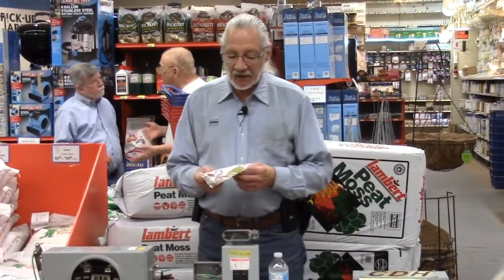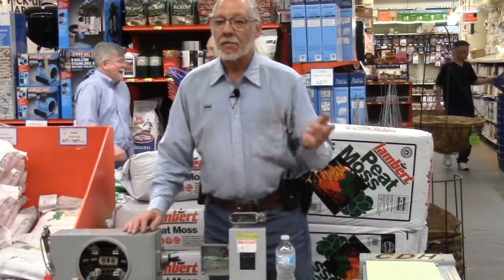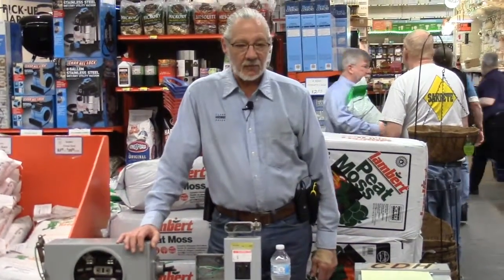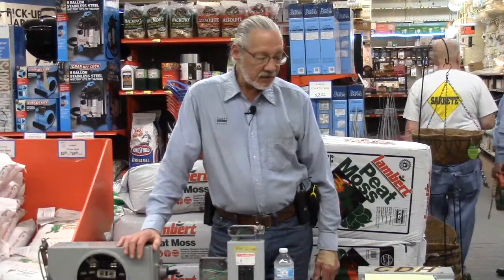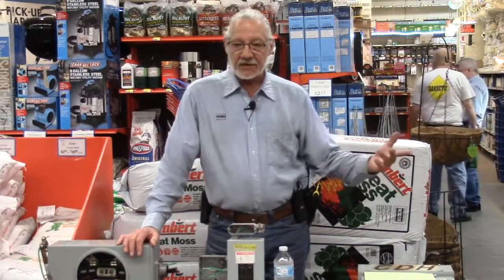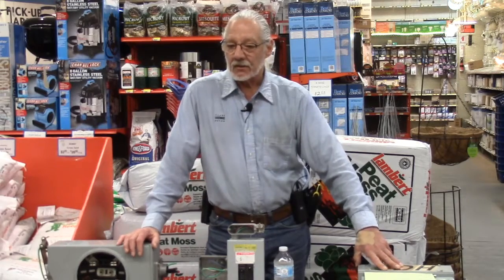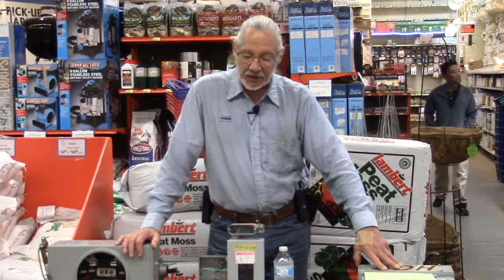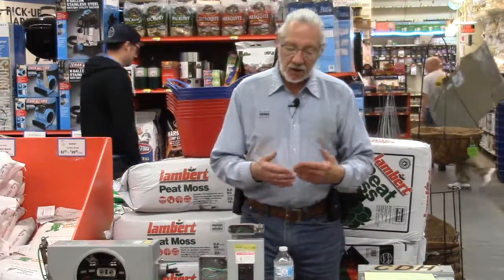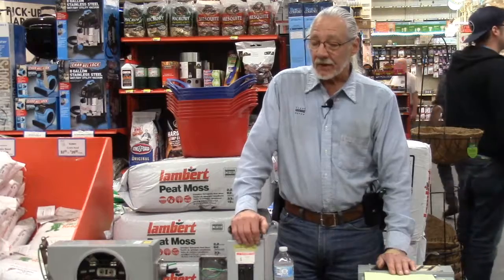Just be aware that if you try and jury rig something and you break that fuse block, there are no replacement parts anymore. So if you break a fuse block, or if it's already broken, you can't get replacement parts anymore. You haven't been able to get them for nearly 10 years now. Ever since the city of Chicago changed their code to say that now you can have emergency lights on a fuse panel, everybody just stopped making those fuse blocks. That was the only reason for those fuse blocks to begin with, other than the very old ones in the house. So if you need to change the amperage in a fuse block, it can be done. Just be aware of the gauge of the wiring and your amperage on your fuses. All right, that's it on fuses, by the way.